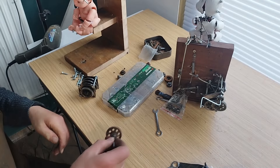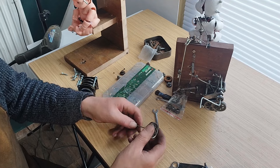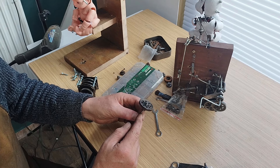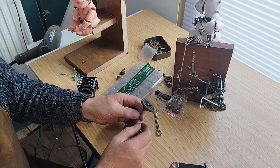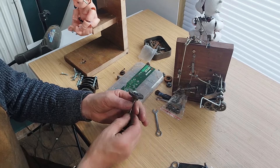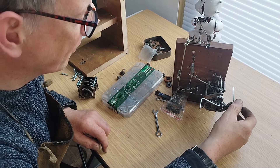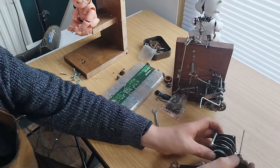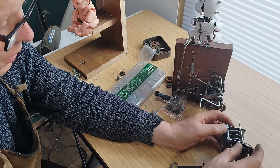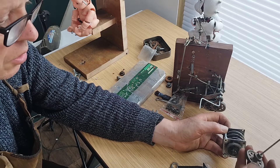So the first job today has been to get a rod. This is a 3mm rod from a garden rake - all the rods from it are really nicely 3mm. This one's held in place with a grub screw. What I've done is put a couple of 3mm nuts into my drill on the end of a bolt and then run it against a sander to get them small enough that they fit nicely in there. The 3mm bolts obviously fit on a 3mm bar, so I slide them inside so I know that it is completely central. So this now will be going here. The next job will be to drill these holes in the right place for this to fit, and drill a hole through at exactly the right distance for the teeth on this to fit the teeth on that.